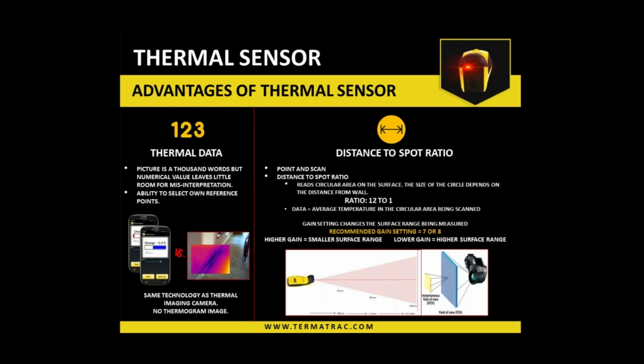No, I think I understand what you're saying. So you're saying the order of which sensor to use, essentially. If I am using a thermal sensor, a camera or anything, and I am using a moisture meter, I detect something, then also later on I have to use the radar. Well, yes, the radar then certainly helps. So your moisture and your thermal sensor, they're picking up any anomalies, if you will. Yes. Okay. Pinpointing or finalizing for the termite identification, I have to use radar.